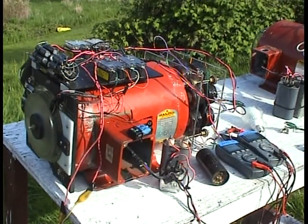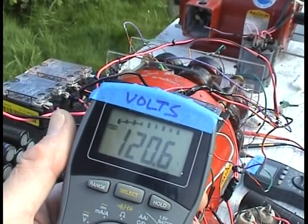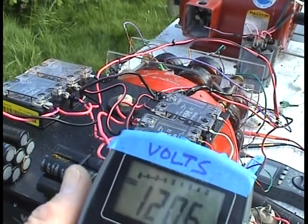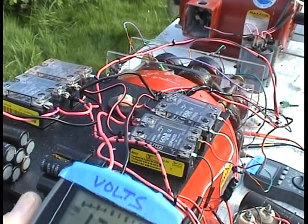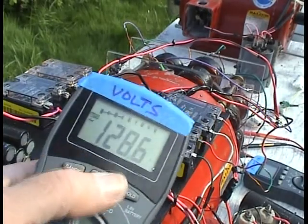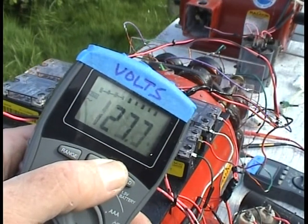It's drawing about 300 milliamps now. Let's just get the other one going. There's 20.6 volts DC in that cap right now, and it's going to be the same in the other cap. I've just hooked up the meter set to AC to the output of the converter, and it reads 120 volts AC — this is what's going to power the other motor.